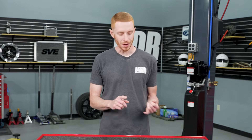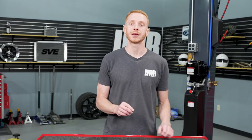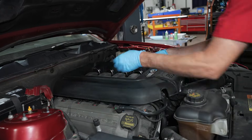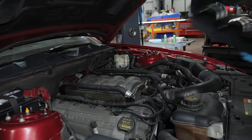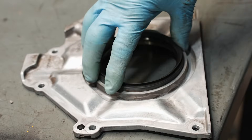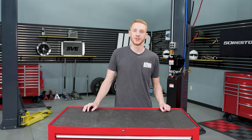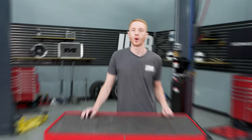It's also good to mention if you have a Mustang with an automatic transmission, make note of the shifter linkage and the automatic transmission cooler lines. If you're watching this video and you have an engine other than the Coyote, most of the steps related to the rear main seal are going to serve you as well — certain engine displacements, certain gear ranges, some components will obviously slightly differ. For this video, we'll be starting with all the transmission-related stuff already out of the way.